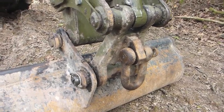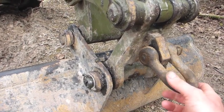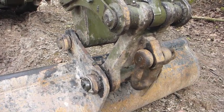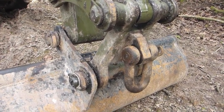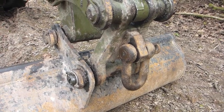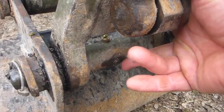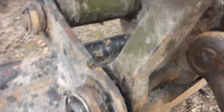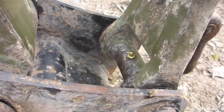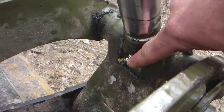Whilst looking at the front of the machine, this is another little mod I did. I welded on this attachment eye here and this shackle kind of lives permanently on here. It's been really handy for recovering my dumper when it gets stuck, which is actually quite often. Another little change I've done is move the grease nipple to where it is much less prone to be damaged. Similarly, there's a nipple there that always gets wrecked, so all I've done is turn the ram around and it's on the inside where it's protected.